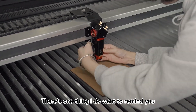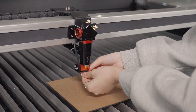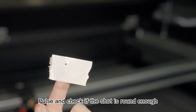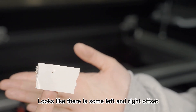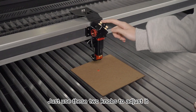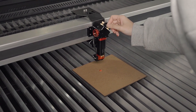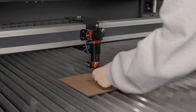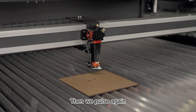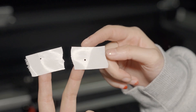There's one thing I want to remind you — make sure it's still at the 10 mark position. Then we put a new tape on the nozzle, pause, and check if the shot is round enough. Apparently this is an oval — looks like there is some left and right offset. Let's see what we can do about that. Just use these two knobs to adjust it. Stick another tape on it, then pause again. Run several tests here until your shot is round enough, just like this one.